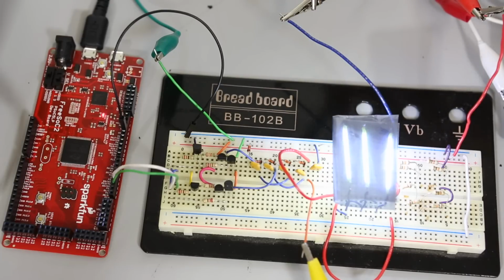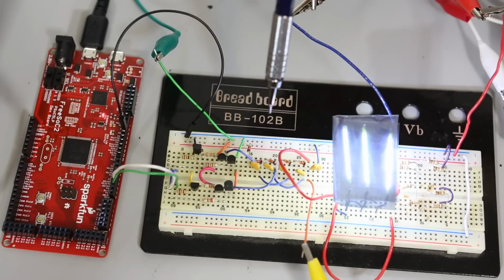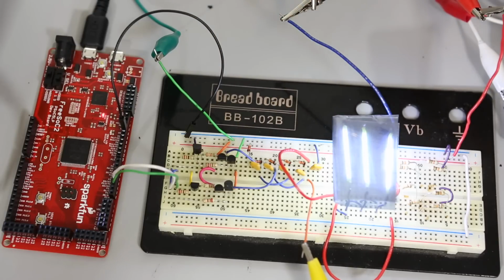But something to consider. The reason these values got picked, number one, they were available for free. Number two, they're not too far off of what I've seen on any given RS-232 driver, right? Those are typically 0.1s. Let's try this and see how it works. So what I got, again, 87% efficiency.